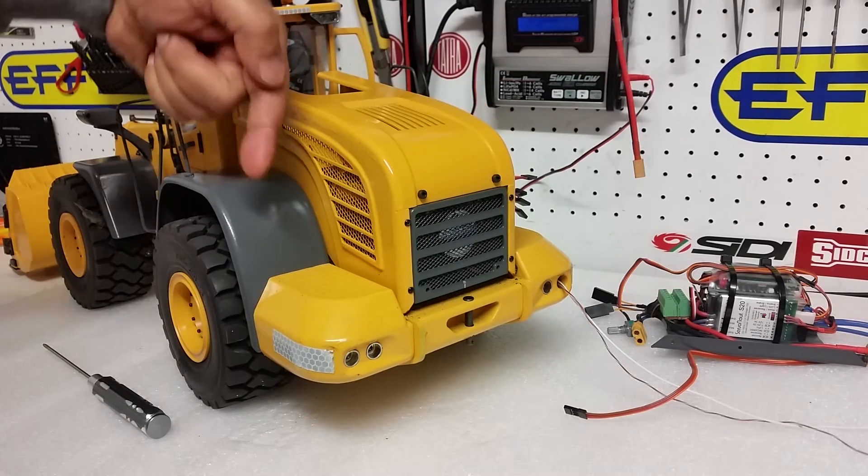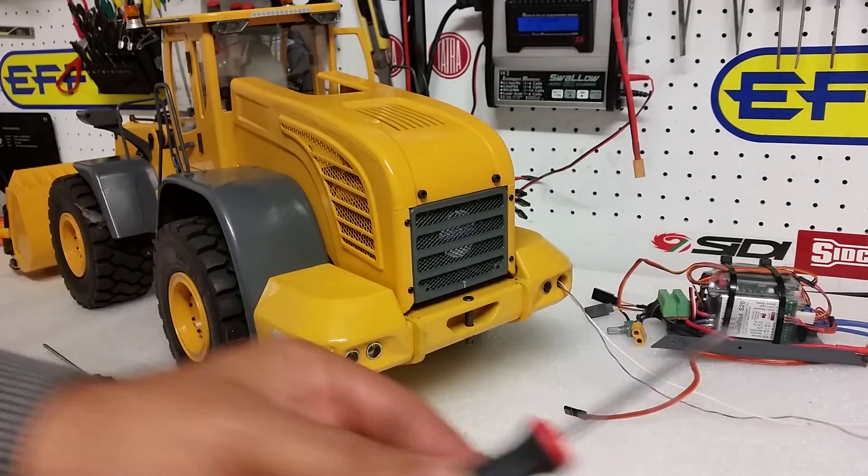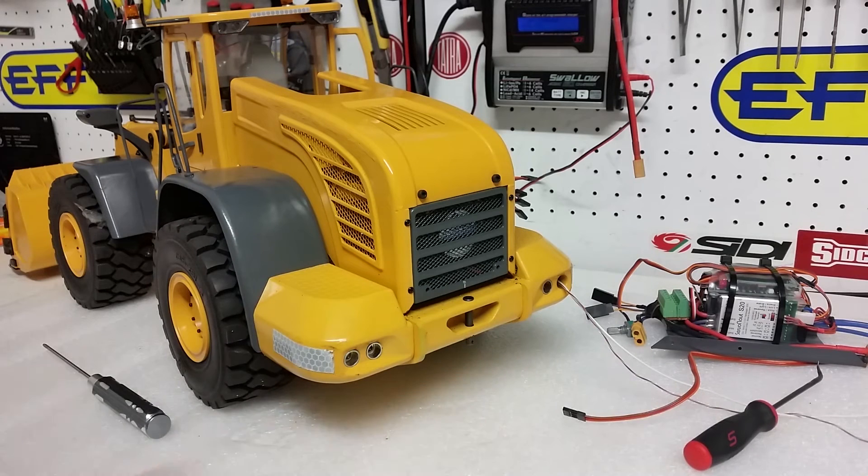The main thing is to feed the wire from the inside so you can pull it out. Use tweezers, a scriber, or an awl — that will make your life a lot easier. Then you will have your brake and taillights working on your wheel loader. The parts for this video — the inserts, the S20 speed controller, and the distribution board — are all available on our website. Email us at info@csmi.com.au or visit www.csmi.com.au. Thank you for your questions and see you on the next video.